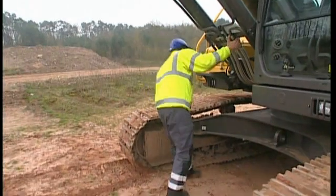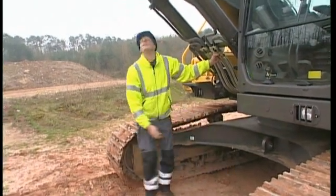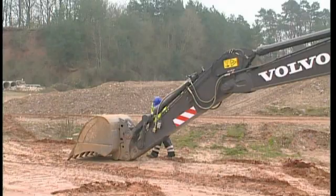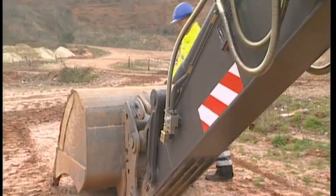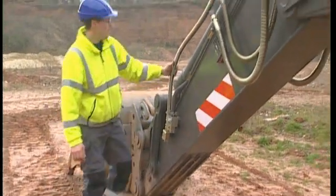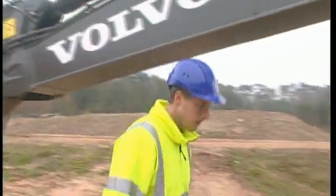It is now time to take a walk around the digging equipment and visually check it. The hydraulic lines may have become slightly damaged at some time and you haven't noticed the leakage yet. Check all connections, pipes and hoses for any external damage. Normally cracks do not occur in the boom or arm, but you can never be sure, especially if you are working in extremely harsh conditions or very cold climatic zones. It pays to take a closer look. The bucket linkage is another place to check because dirt or small pieces of rock can easily get in between the components.